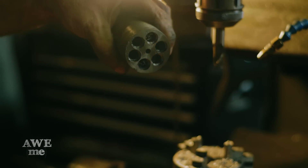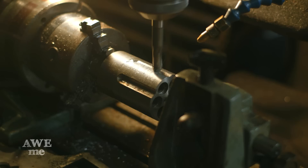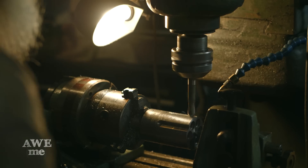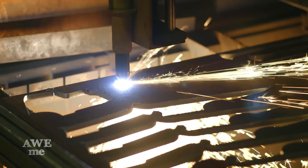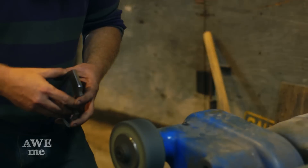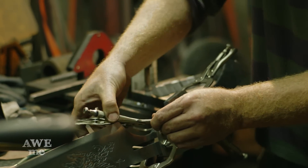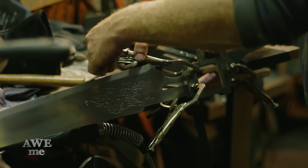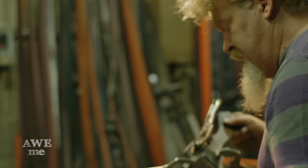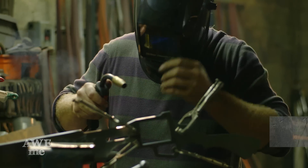We lay the indexing head over so that it can cut horizontally — this is so we can flute the cylinder. John then cuts additional sections of the frame for me to add to the gun section. I'm adding some clamps so that I've got a fairly flush surface before doing any welding. This will get welded on this side, reinforcing the whole piece, and then it'll get blended out to match so that it looks like it's all one piece. For the external welds I'm using a MIG welder; for the internal welds I'll use a TIG so we have less cleanup.